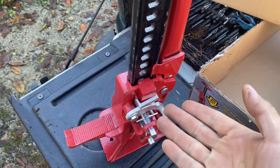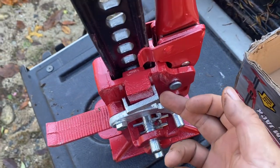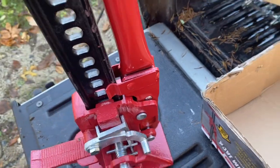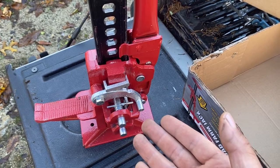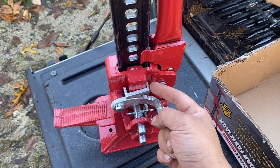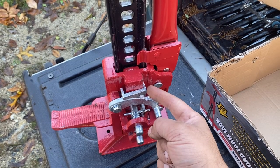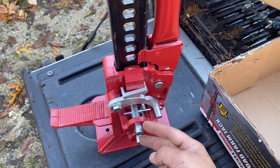The only major issue you'll have is lubrication. Here, this very rough part catches on the very rough finish of the slides that it's sliding on, and there is too much friction for it to operate properly. On the upstroke, it works okay. On the downstroke, this piece does not fall down as it should, and it doesn't move as it should. It gets caught, and as a result, this doesn't work.